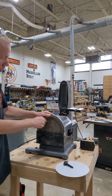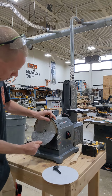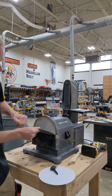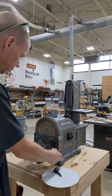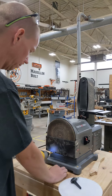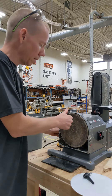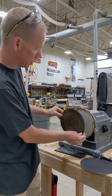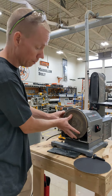The table slides off, and then you just peel the sandpaper off. As it goes around, keep pulling. A lot of times it'll want to re-stick itself as you pull. If that's the case, you'll need to remove these screws — it looks like there are six of them. Then pull it all the way off. When you put the new one on, peel the backing off and center it the best you can. I'm putting the old one back on because it's still in pretty good shape — I don't want to waste it.